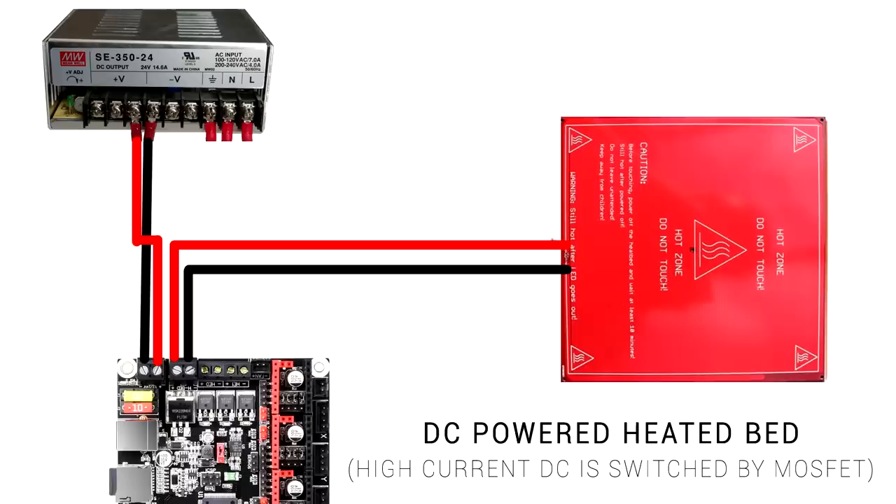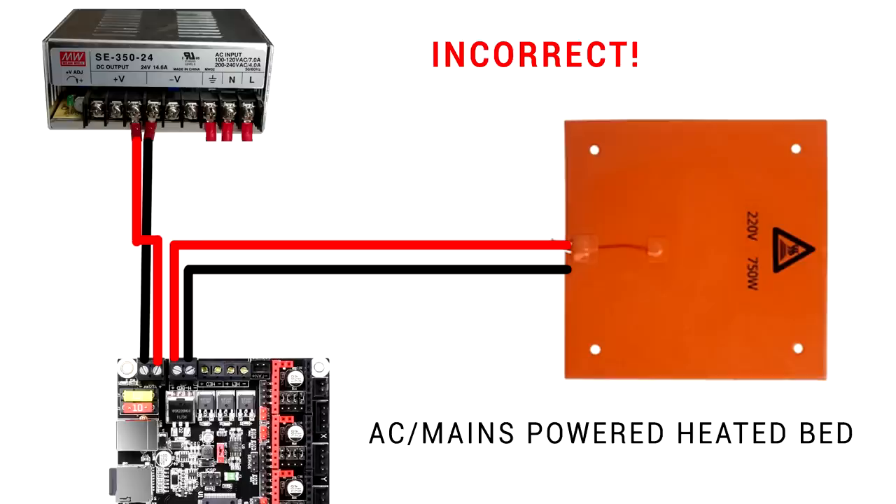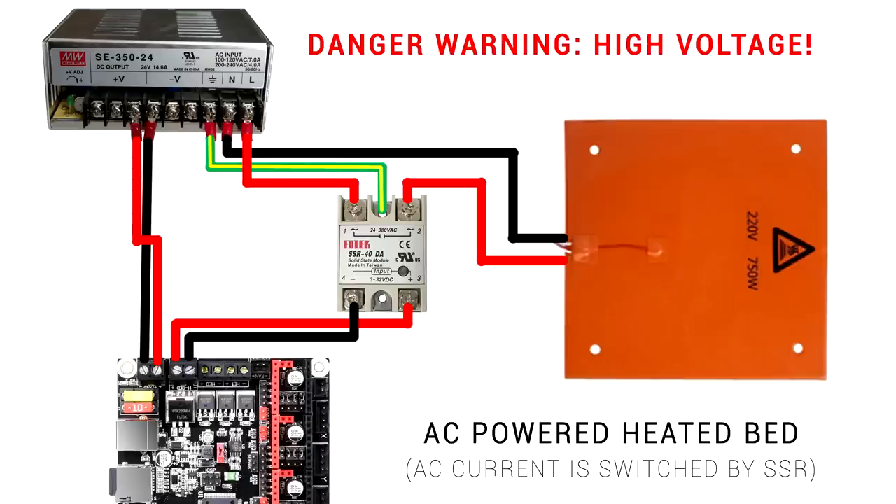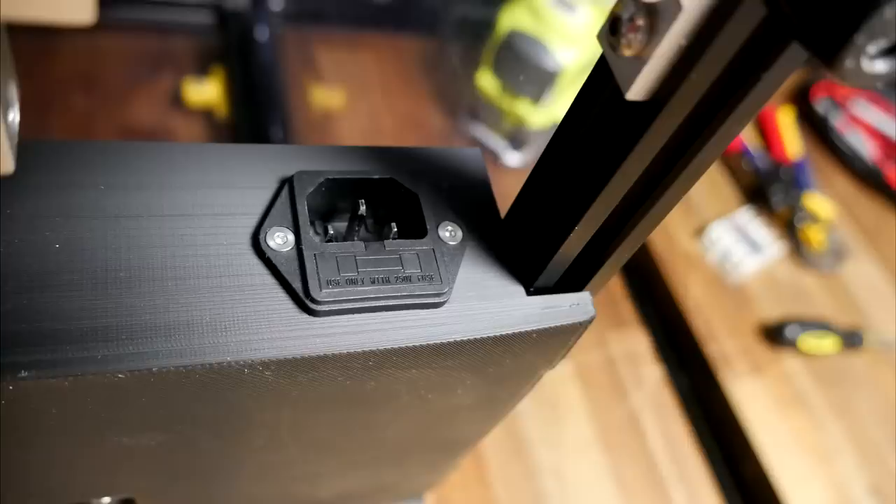The old wiring for the original heated bed was pretty straightforward — 24 volts came in from the power supply, and a MOSFET was used to switch that and regulate power to the heated bed. You might think you can simply plug in the new heater wires the same way, but performance will be terrible as it's expecting a lot more power. As we're using high voltage alternating current from the wall, that would fry the MOSFET, so we need to introduce a solid state relay. We run some thin gauge wire from the bed output to the DC inputs of the SSR, matching the polarity. One wire goes directly to the pin labelled N for neutral; the other, labelled L for live, comes out of the power supply into one end of the SSR, then exits the SSR up to the heated silicon pad. The SSR will allow current through only when it gets a signal from the main board. We'll explain the green and yellow earth wire shortly.